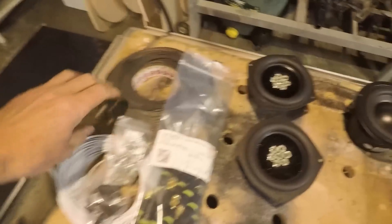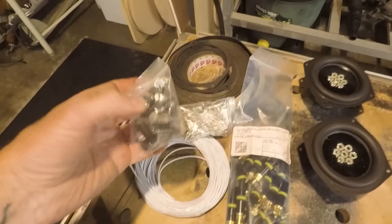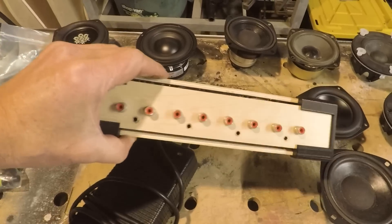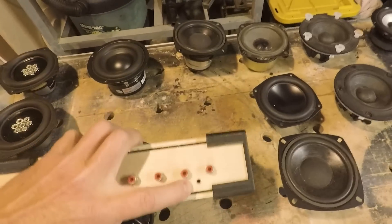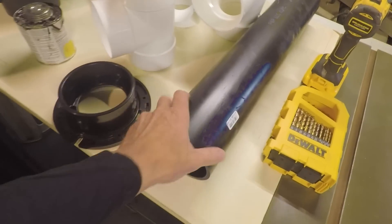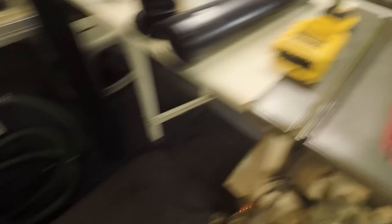So let's see what we've got here. I've accumulated a mish-mash of speakers — I'm not really sure which ones we'll use, but we'll build this up. Here's some foam, some connectors, speaker wire, lugs, and these little snap-on connectors that'll work with the speaker wire. Here's a little eight-channel amp I built a while back with eight little 20 or 30-watt Class D amplifiers. It's got a stereo mini in and two RCAs for speaker power out. Here is what we'll build the speaker out of: some four-inch PVC tubes, insulation, drill, and tools.